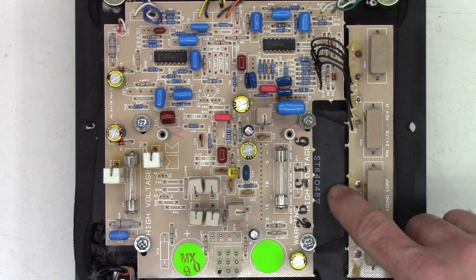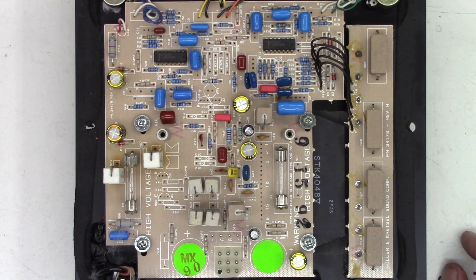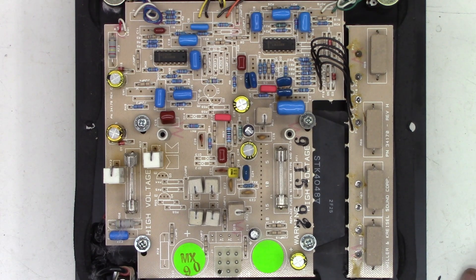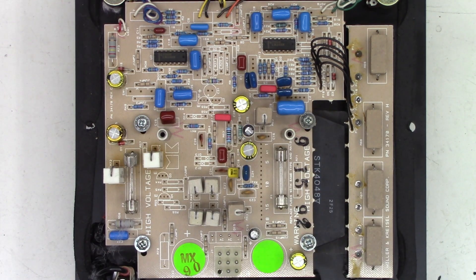Short of a failing hybrid power pack IC or a failing op amp. Op amps typically are very, very resilient — rarely do they fail unless they've been physically or electrically damaged somehow. Power pack hybrid ICs, those things do fail quite often. I also see six electrolytic capacitors on this board, and you know the history I have with electrolytic capacitors and high ESRs.